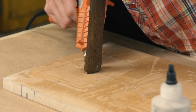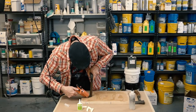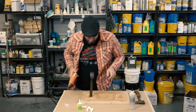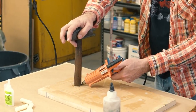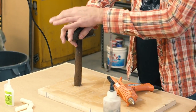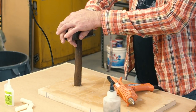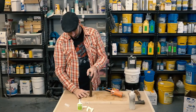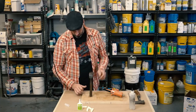You're also looking at the volume and shape of the thing you're molding. Here it's top heavy — we're talking about these tools like a hammer — and you also need to think about where the opening is going to be. Is it at the top of the hammer or at the handle? You want to do what makes sense for pouring material into the mold quickly and not disturbing too much detail. There are nice little rivets on the bottom of this axe that I don't want to clog up with a pour spout.